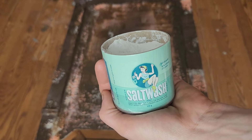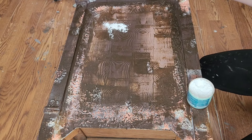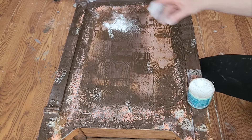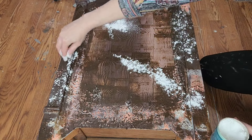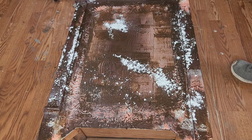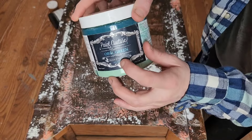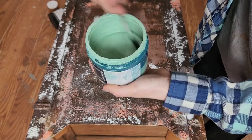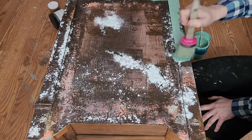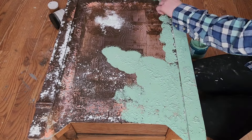Here's an up close look at that faux wood grain and texture. Next up we are going to be adding salt wash, using it as a paint resist. I'm going to sprinkle it over the areas where I want the wood to show through the subsequent layers of paint. Then I'll take my misting bottle and mist this product — as it dries it will become hard, creating a perfect paint resist. My grandmother was very partial to this type of green, so I custom mixed a base of Pink Couture's chalk style paint in Opal Green, added Candlelight, then tinted it with Pink Couture's concentrated color pigments. To add even more texture, I stippled this paint on instead of brushing it.